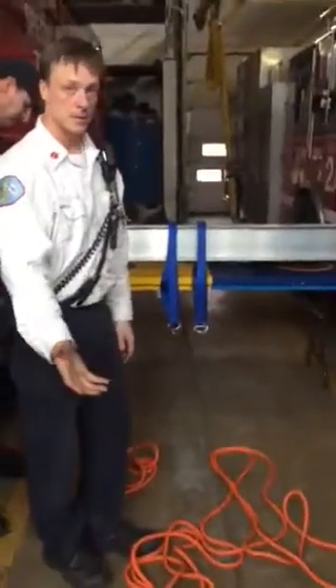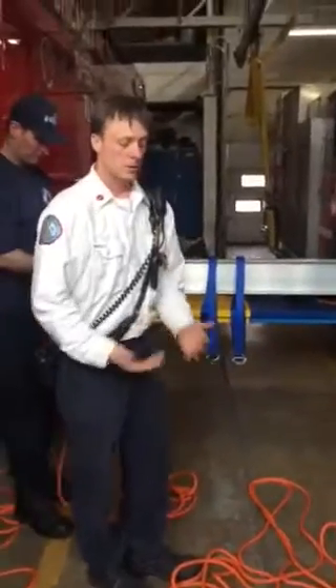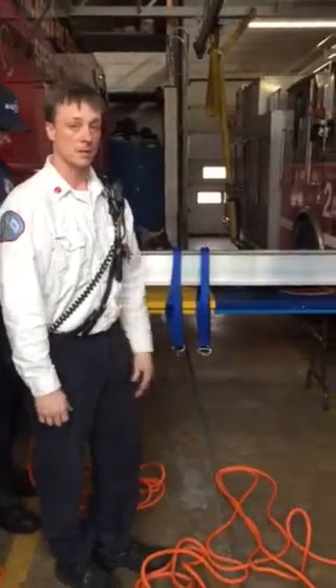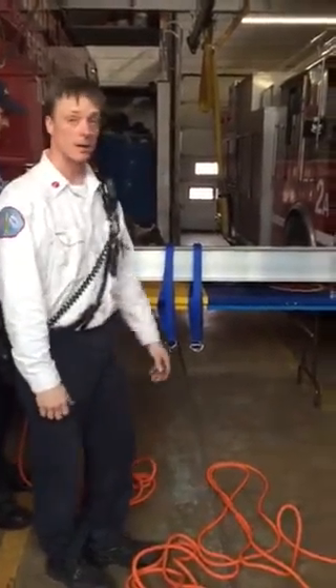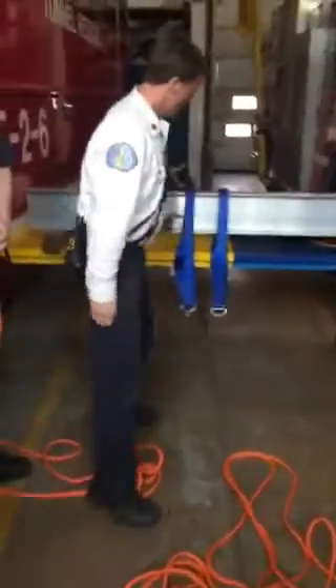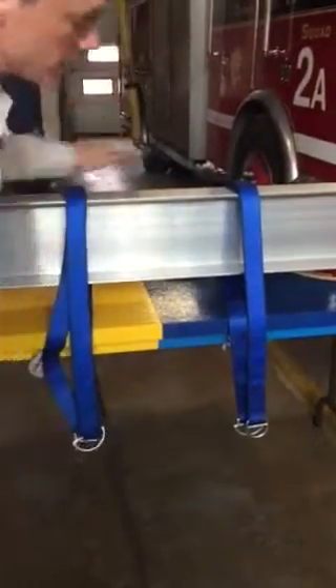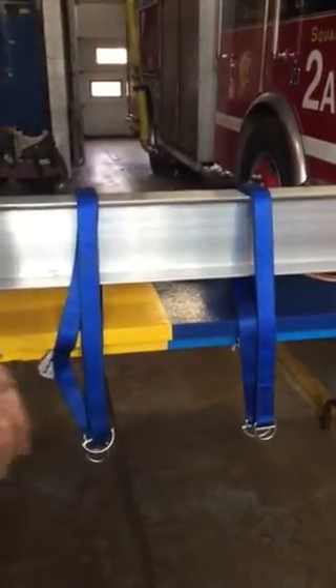This is the setup we came up with for setting up a two-anchor — a main and a belay system — using this I-beam for an elevator shaft. Here's the I-beam. Normally we're going to take two anchor straps, wrap them in the appropriate method around your I-beam, one establishing the main and one for the belay.